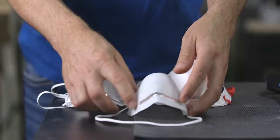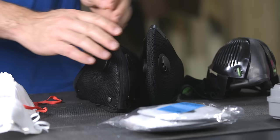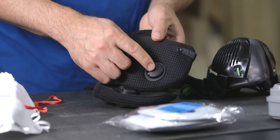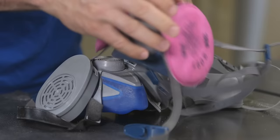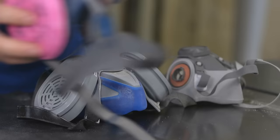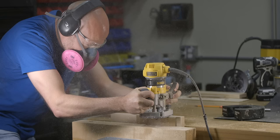That reminds me — we haven't yet talked about masks that have exhaust ports and masks that don't. Masks with exhaust ports allow the hot air you're breathing out to escape the mask; otherwise, that hot humid air stays inside, which is pretty unpleasant. The basic dust masks and some N95s do not have an exhaust port, but other N95s do. All the other masks on the table have exhaust ports — the RZ and Basecamp masks have them, the Trend mask has them, and the half-face masks have ports on the front, while the 3M has its port facing down. Having the port facing down is really important because it stops your safety glasses from fogging up when you're working hard and expelling a lot of moisture.